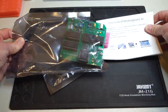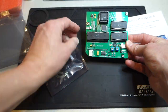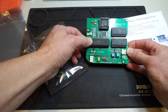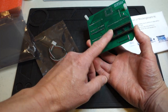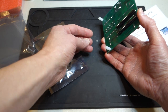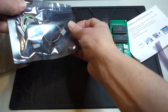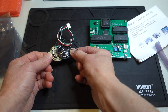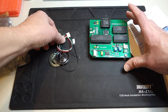This is a brand new board from Ian Kim. It's basically a drop-in board that sits inside the Apple IIc and it comes with a 65C02. What you do is unplug your existing CPU and just plug this board in on top — it fits in the space right above the CPU. Ian has also thoughtfully included a pair of speakers so you can actually get the stereo output from the Mockingboard 4C. So let's go ahead and take apart my Apple IIc and install the card.